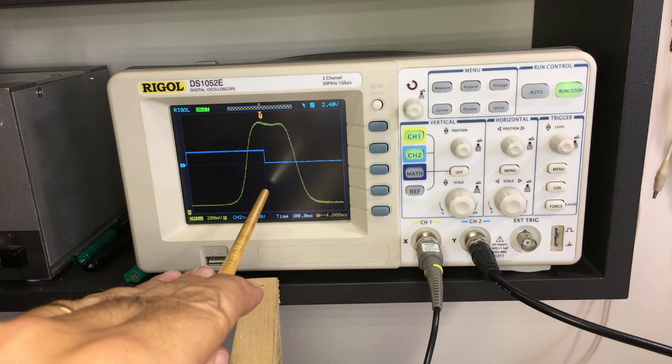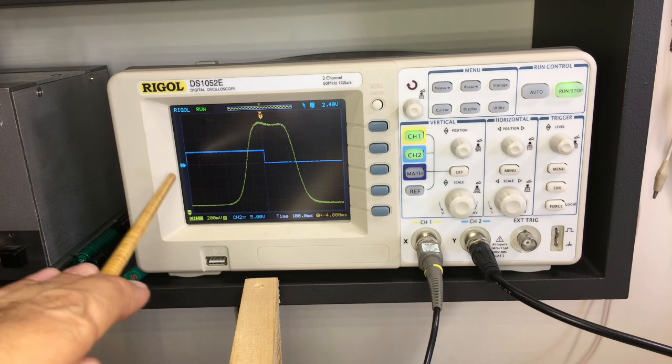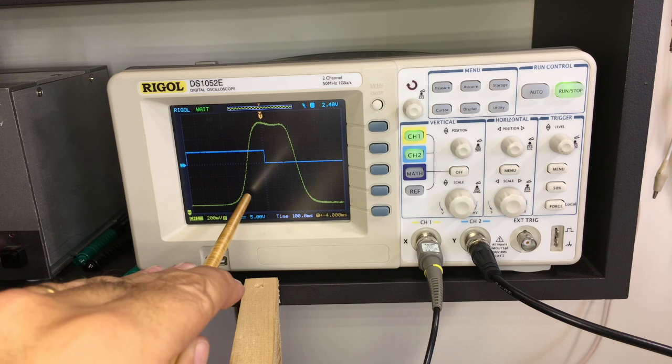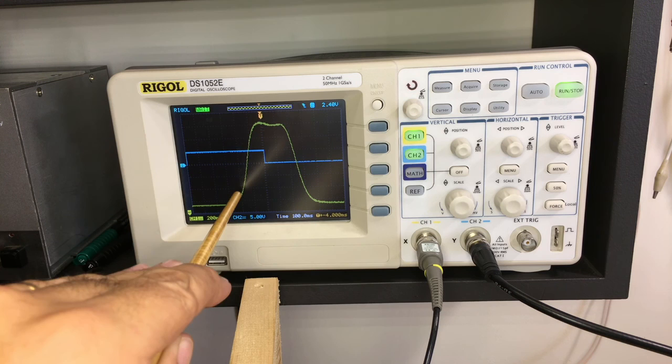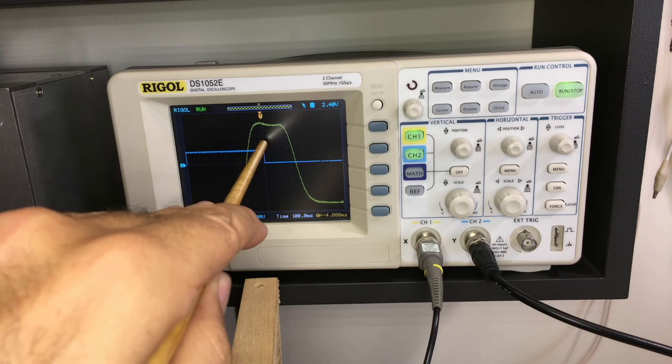Because we know that this here is 11 megahertz at the top, 10.7 in the middle, and 10.4 at the bottom, we know that this is 300 kilohertz, which means it's 50 kilohertz per division, okay? So I can tell that over here I've got 50 kilohertz, there I've got 100 kilohertz. So between there and there, I've got 150 kilohertz, although it is not centered at 10.7.